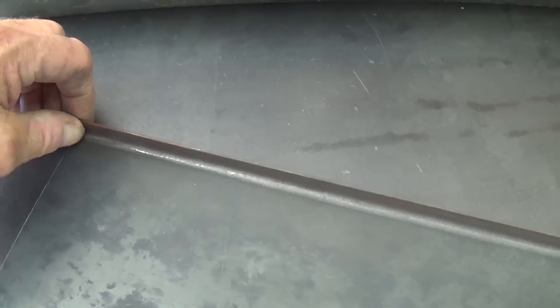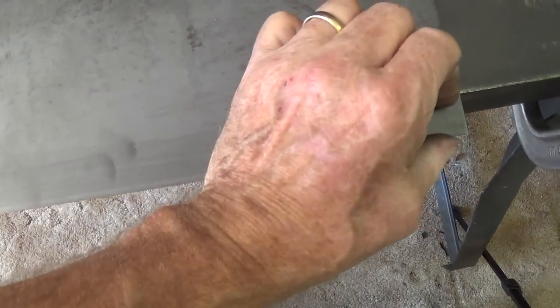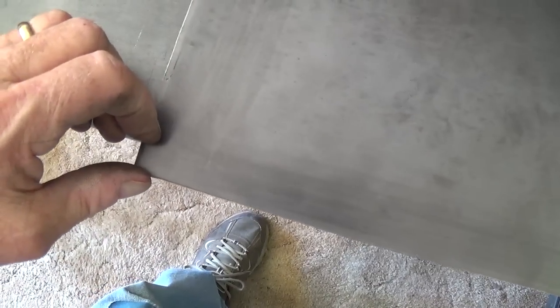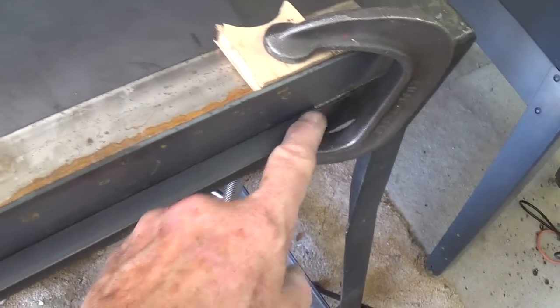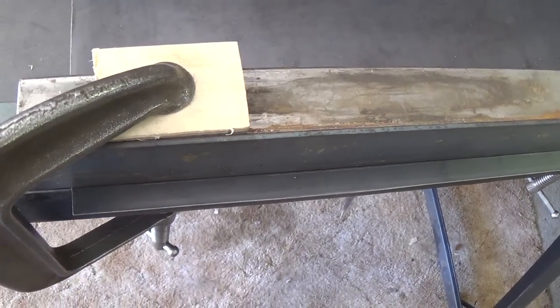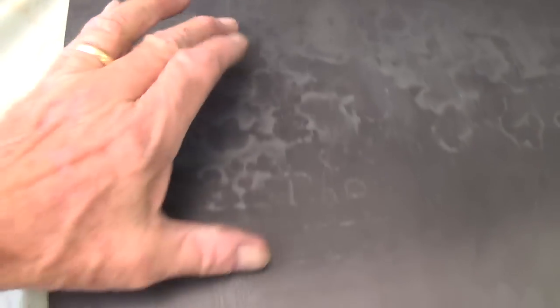This flange is what we'll use to secure the upper back panel of the amplifier cabinet. Then we're going to flip it around and do exactly the same thing — bend a 90 degree bend 1.5 inches back from the other edge. So now we're set up exactly like we were with the first bend and we're ready to make the second 90-degree bend. If we've done everything right, we have two 1.5 inch 90-degree bends on the long sides of our chassis. Now it's time to make the bends in the middle and turn this into that capital C.